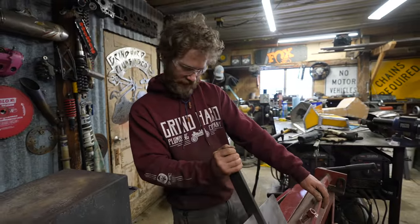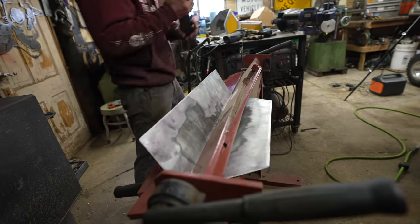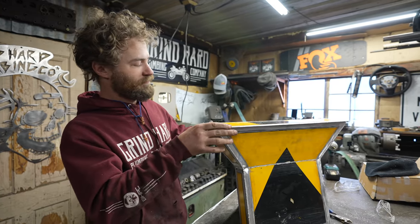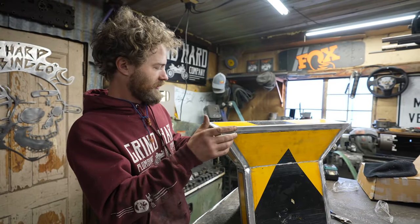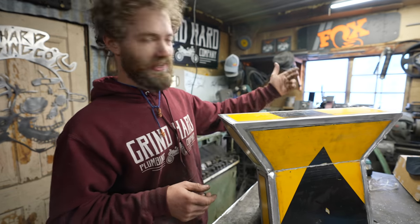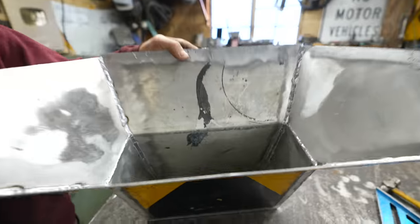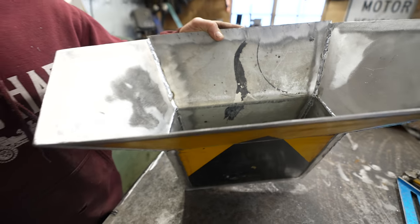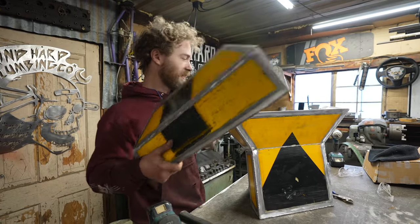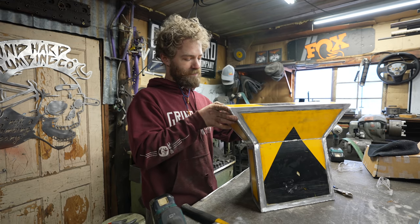I am gradually getting this piece bent, but at this point it would have saved me a lot of time if I'd just cut it and welded it — but sometimes I'm just really stubborn. It's about time to put a lid on this thing. It turned out pretty close — I'm just going to go with it at this angle and trim the excess off the corners. I also went ahead and welded every seam I could on the inside as I went, because it takes a few extra minutes and it might mean it'll never leak.